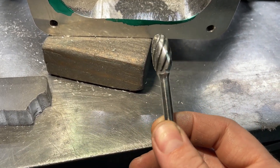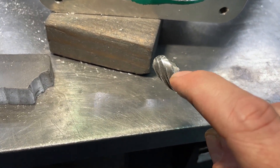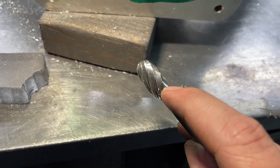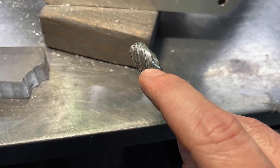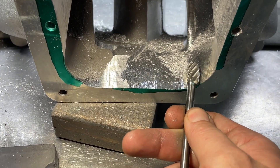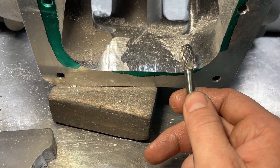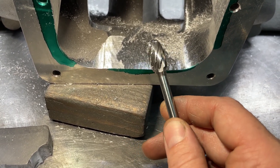There are several types of burrs you can use. This one's called an aluminum cut burr — the flutes are further apart. Some have even fewer flutes spaced even further apart. The closer the spacing, the quicker they'll clog. When you grind aluminum, the heat from chunking out material will cause clogging. The further apart the flutes, usually they don't clog as bad. So this one's good for aluminum.